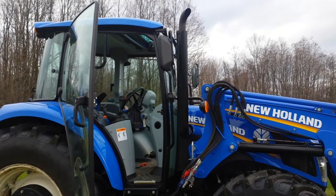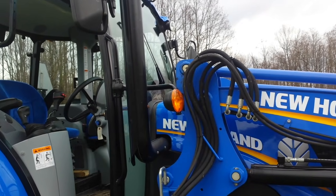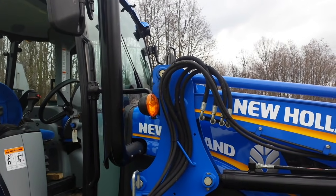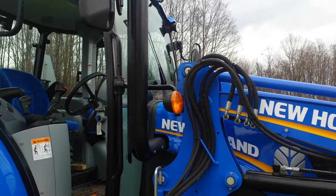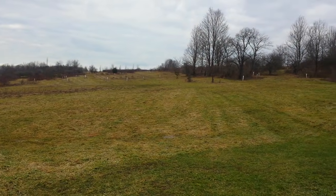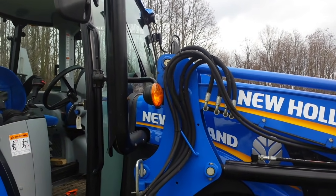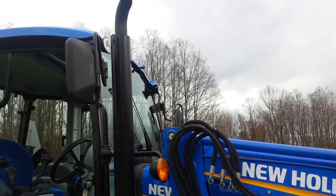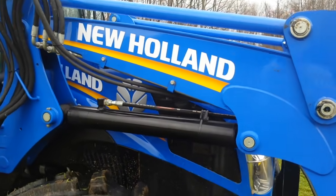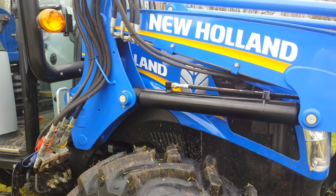This tractor does have an emissions package — it's got a diesel particulate filter. Depending on what I'm doing, if it's idling a lot and not under much stress, it tends to regenerate a little more often. I was brush hogging weekend after weekend and it never went into one; I started doing some idling and it did. It's fairly unobtrusive — the exhaust does get warm — but the tractor doesn't smoke, which is a benefit of the DPF. This does not have selective catalytic reduction, so there's no diesel exhaust fluid required; that was on the next model year.